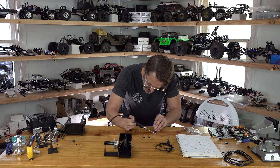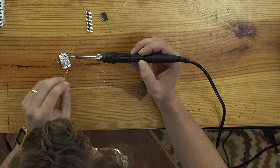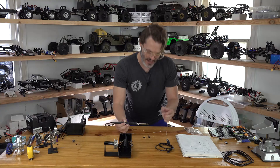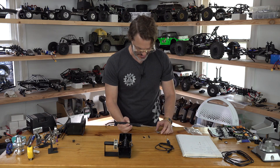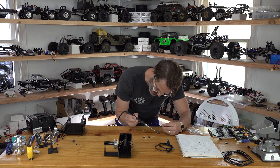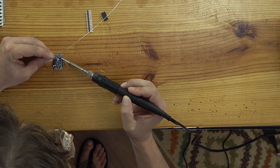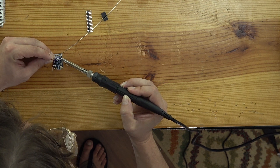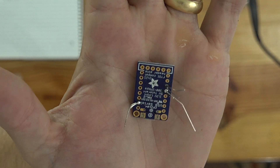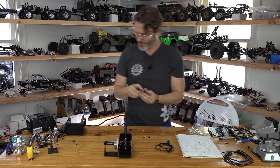You want to make sure that the solder has a nice connection with the pad underneath — a nice fillet. Since these have gold-plated pads, it flows on pretty nicely and easily. I'm just using the corner of my soldering iron since it's an oversized tip for this job, but it gets it done. Flow a little bit in there and you can see where it is right now. Now I will cut those leads off.